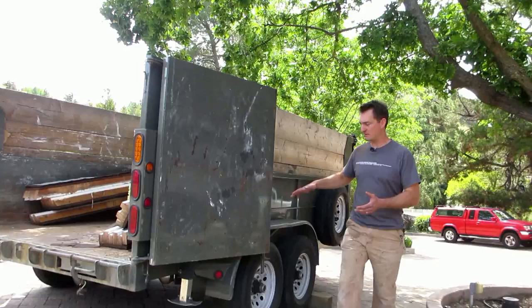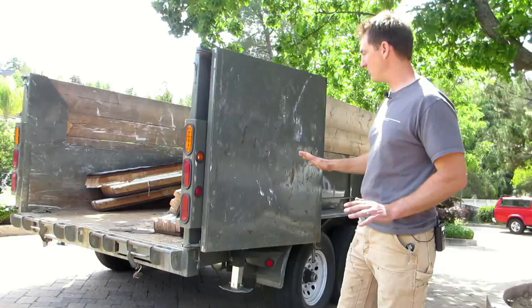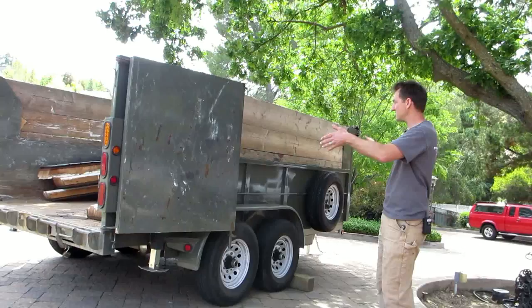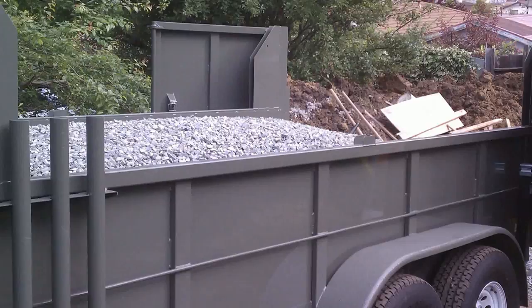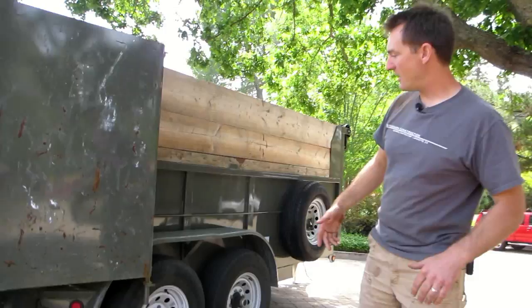What's really different with this trailer is most dump trailers have a two-foot bedside all the way around, and to get extra height they add on either metal or wood stick sides. My old trailer had it that way and it got old. So I did the sides the same full height, so when you're loading with a skid steer you can remove all this and get it a lot lower. You can also hand load from the side if you're in a tight spot. I stacked a 2x4 at the bottom so the machine won't bash it when loading.